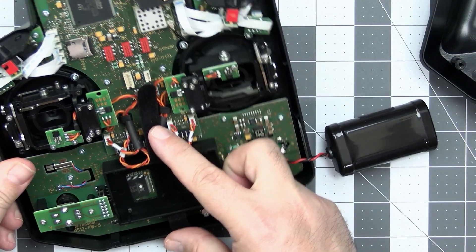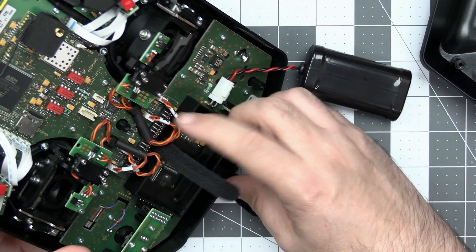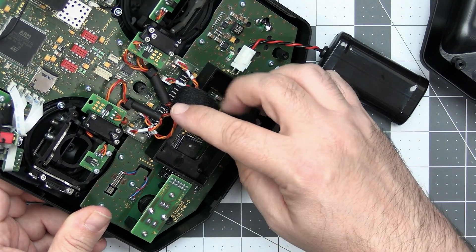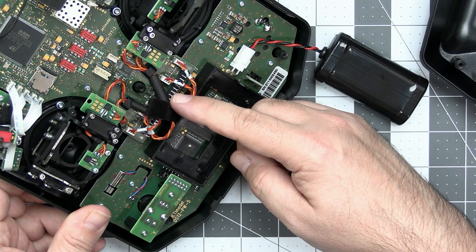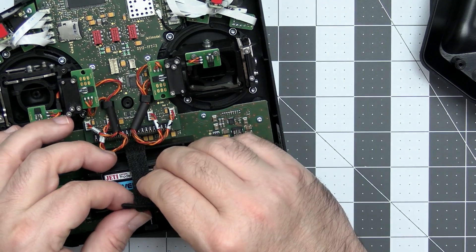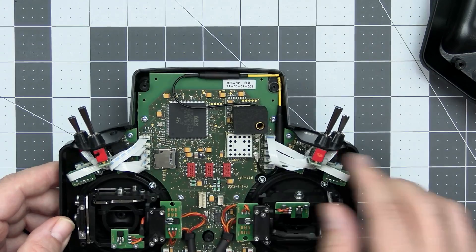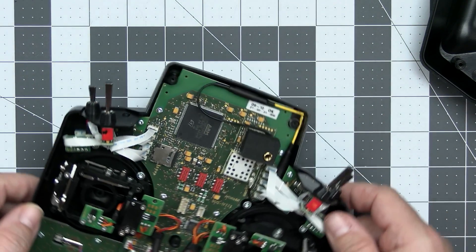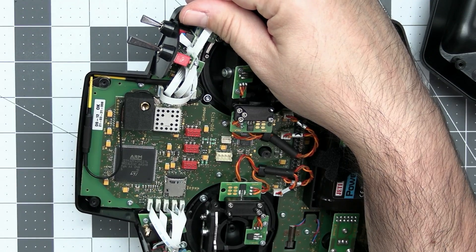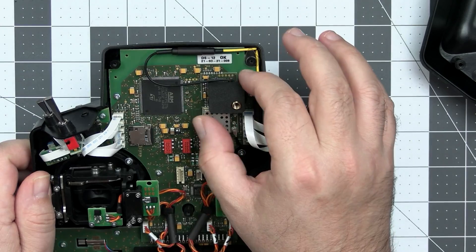There's some special hardware — I can see an ATmega MCU here. I have no idea what the ATmega is doing, but I don't think it's critical right now. What's more interesting is on the top there's a pretty big STM32 — specifically the STM32F439 — in a huge package with all those connections. Then we go into the radio section.